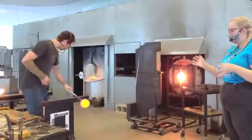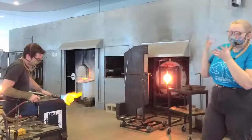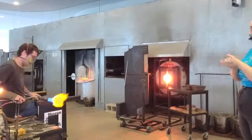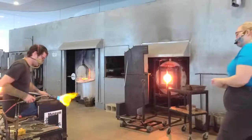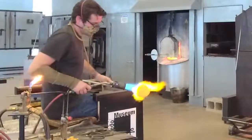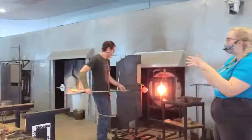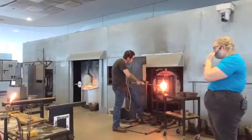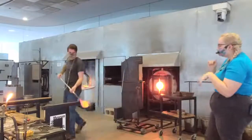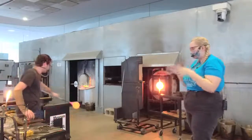We can't ever touch these objects while we're working on them — we really have to do it from experience. If Misha makes this apple really top-heavy and it's just on a shelf, it's a surprising material: if a cap or something bumps into it, it can really easily knock over and break. He's doing a little bit of spot heating with the fluffy torch, using it because of the nice big fluffy flame. We want it thin on the top and thick on the bottom. When you first start making pieces, you make them really thick on the top and really thin on the bottom, but you quickly find out that's not how you want to do it.